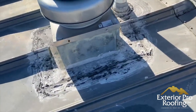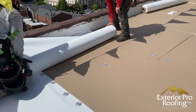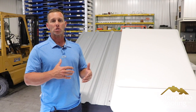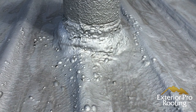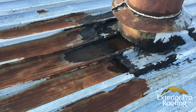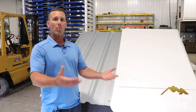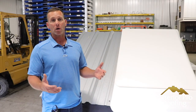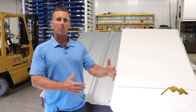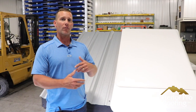The first comparison is the idea of a coating versus installing a roofing membrane over top of the metal. Right off the bat, I'm not a big fan of the coating idea, because with a coating you're going to install multiple layers of a paint or sealant — rolling or spraying it on — and trying to build a membrane on the metal roof in place. Weather is one of the main reasons I don't like it, because I'm going to try to build this membrane with multiple coats out in the weather with different relative humidities, temperatures, and amounts of sun.